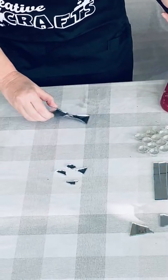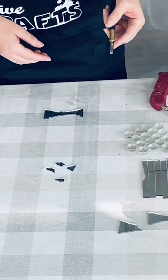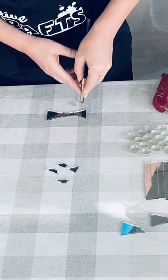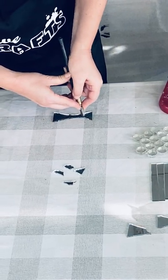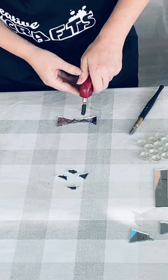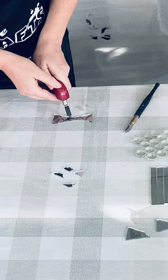What I want to do is put the glass close to me — best to do this when you're standing — and I'm going to make what's called a score. I'm going to put the tool at 90 degrees and lean into it. I'm going to use this tool now. The head moves — it's not broken, this is how it works. I'm just going to lean into the cut.